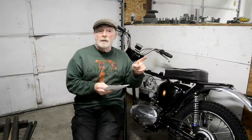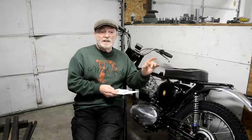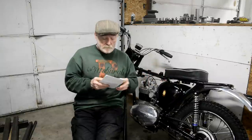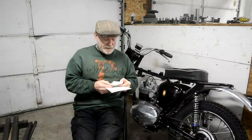I was asked about the Henderson. I'll mention that because I've been asked over a couple of weeks. I'm still waiting for half the crankcase where the bearings are getting rebabbited, and the conrods with the rebabbited big ends. I know they've done all the babbitting because they needed an extra piece to do the line boring, a piece that goes on the end of the crank, and I had to send it off. So that's what I'm waiting for. I've spoken to people who make pistons, and they've made pistons for Henderson before, so we're all set to go there when I get the barrels done. I've got valves and valve springs and all the rest of it. So really what I'm waiting on is getting this crank back and the case with the babbitting. Oh, and those people are also repairing the camshaft. You remember all the lobes but one were really badly pitted. So they're repairing that.